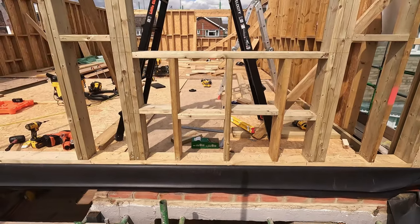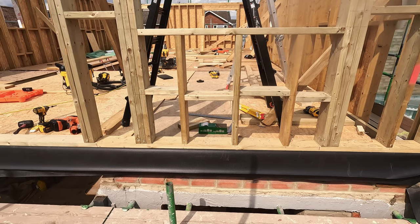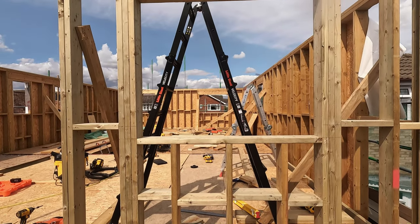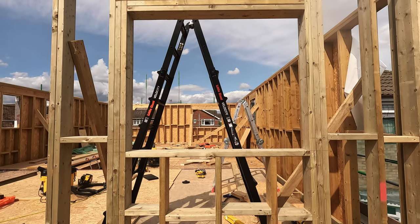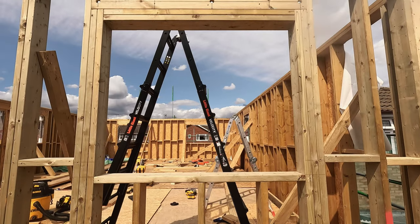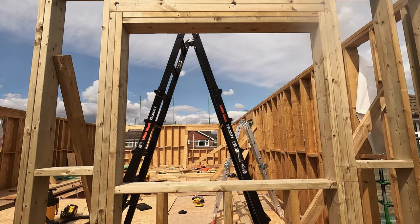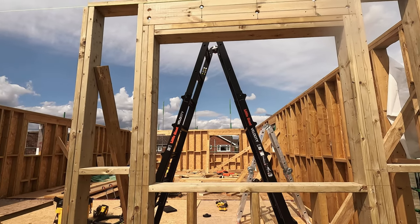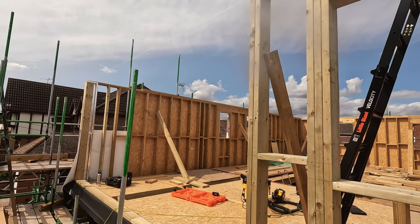There's a little bit of clearance around the whole of it, just like I said earlier, for expansion and for clearances for the window, but I'd imagine the surveyor will measure and build the windows to fit whatever opening there is. The only critical thing now is to make sure that I plumb across and level it across to the wall over that side when I build that. I've run out of wood now, so the next stage is to start cladding it.